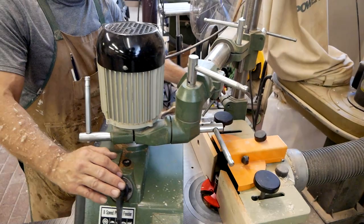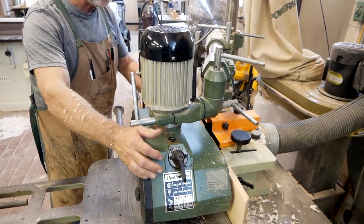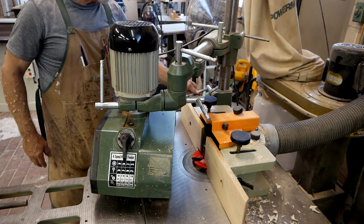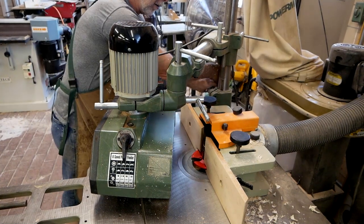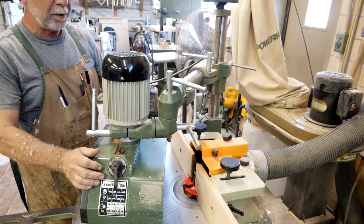And when that starts pulling through, it pulls your power feeder into your shaper cutter, and that's why you get that damage. Now, is that because it wasn't tightened properly? Yeah, this just wasn't tightened down properly. You think you have to get it pretty tight, but you really want to crank down on that thing. You got to put a little bit, then just a little bit more to make sure that thing is good and solid. Okay. You don't want that moving.